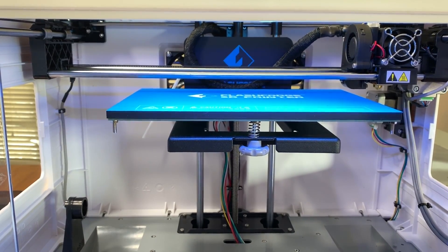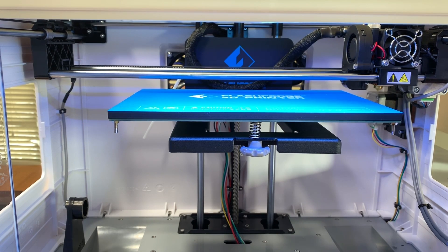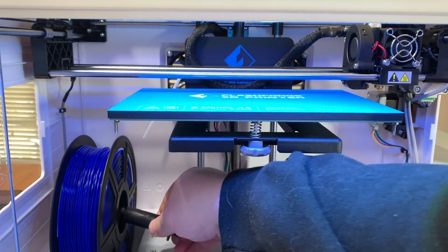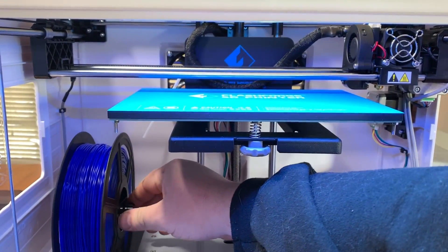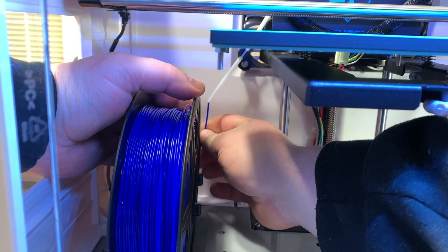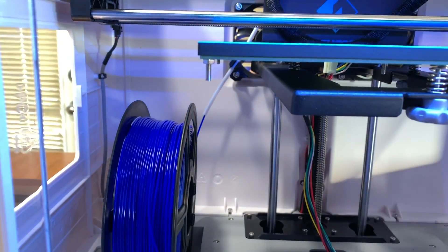Now the fun begins — I'm going to put some filament in and I've got the program ready. It's a program originally for the Flash Forge Finder that I modified for the Dreamer NX to help fine-tune the bed and get it leveled up. The filament gets fed in like this — slide it into place and use this key to lock it. The filament has got to be fed from the back as shown, and you see this white straw here — you've got to feed the filament up into there.